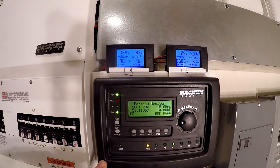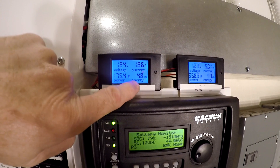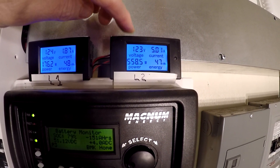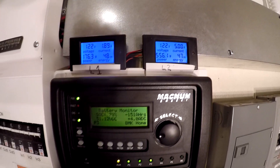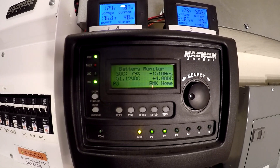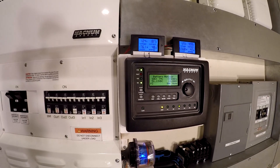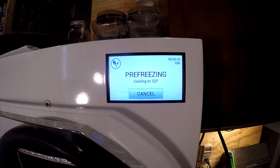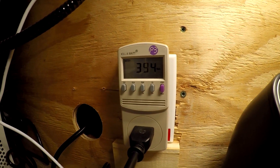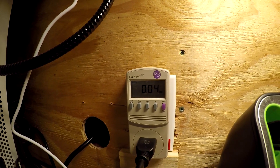This is the output of my solar power system — this is for the whole house. I've got L1 and L2. On L1 we're pulling 175 watts, and we started at 47 kilowatt hours this morning. On L2 we've got 561 watts — the freeze dryer is on L2. The battery is at 79% charge and we're currently putting 4 amps into the battery bank. The sun's just coming up, trying to poke through the clouds. The freeze dryer is cooling down — it's currently at 69 degrees and it's pulling about 390 watts, basically just the compressor.